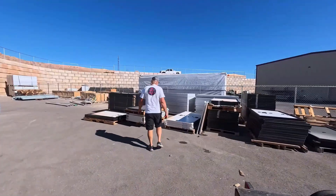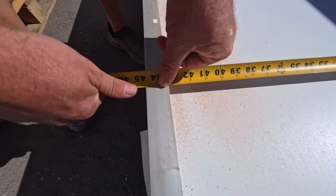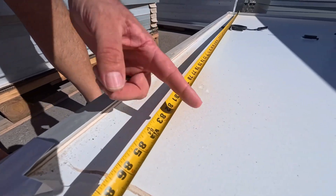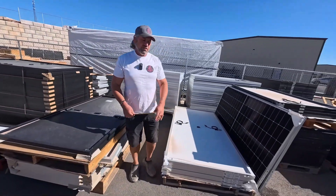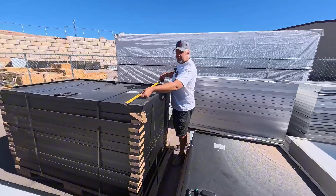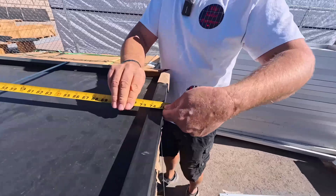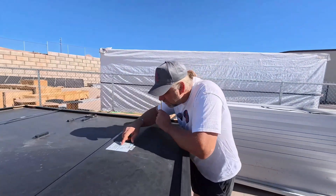We're going to look at these panels over here. This one we're looking at for the blue cart — the existing top is 44 inches, and this panel is just barely wider than that. It's about 80 inches long, so a little longer than the current top. This is a 535 watt panel. Over here is one that's the same width but only 75 inches long — that's a 440 watt panel. And there's another option that's a lot narrower at about 69 inches — that's a 350 watt panel — which you'd use if you wanted to go wider and put two panels on.